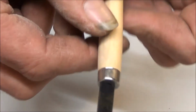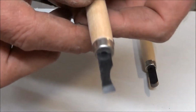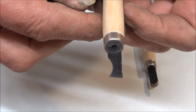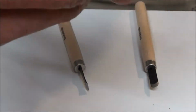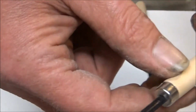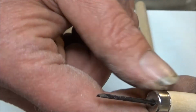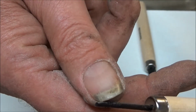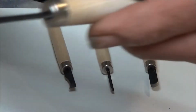I'll just show you different blades. Now these are designed for like doing some, you know, there's a curved blade. It's for getting into places. Try and lay them out. I mean, there's some really handy shaped blades here. Now, they do want sharpening. I have had a slight go at some of them. But they're not bad. The handle's not bad. The grind on them, it's not bad. You can see that's about a 20, 22. The angle's pretty good on them.